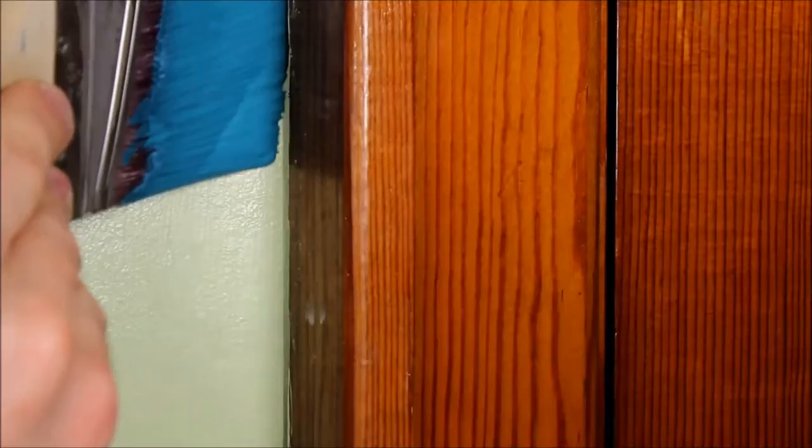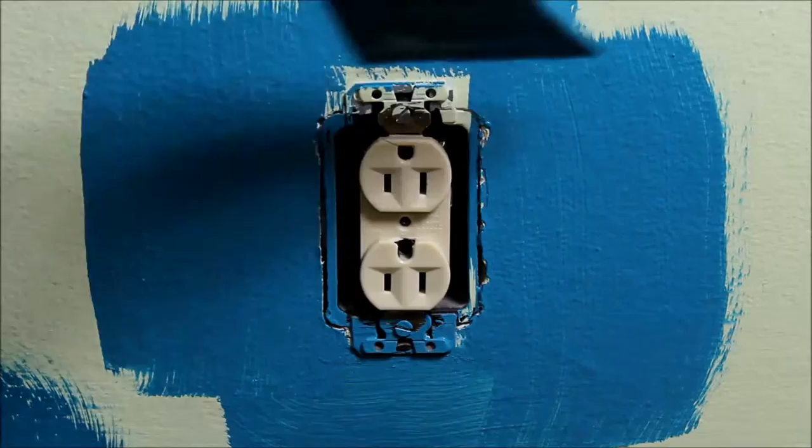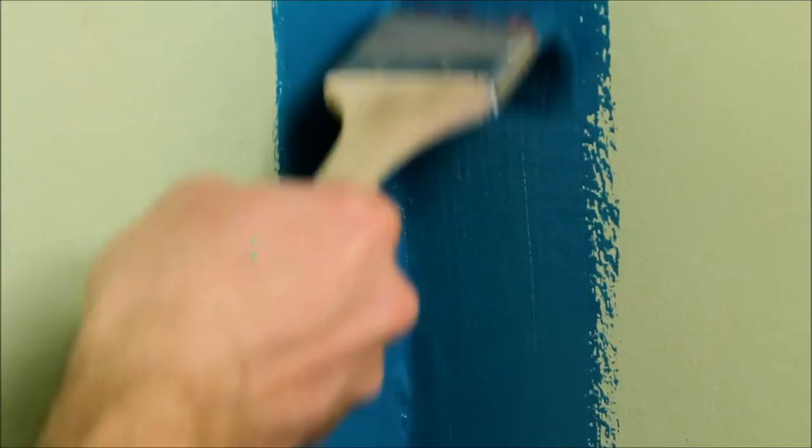Painting the baseboard is pretty much the same as painting the ceiling. I chose not to put a tarp down or tape anything off just to see if my technique was good enough — this is the last room I'm painting in my house. Go over everything with a roller just to match the texture. Painting around doors and windows is pretty much the same process. Painting around outlets and light switches is a lot easier if you take the covers off — just throw some paint on there and match the textures with the roller. For corners, simply throw the paint in the corner, do a little bit on the sides with your brush, and then match it with the roller.